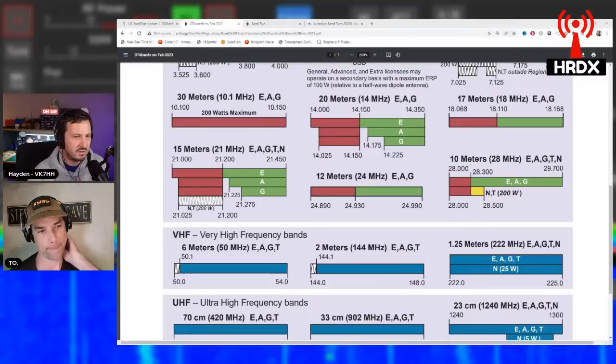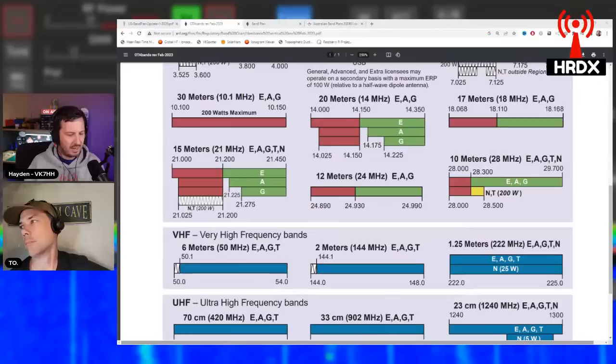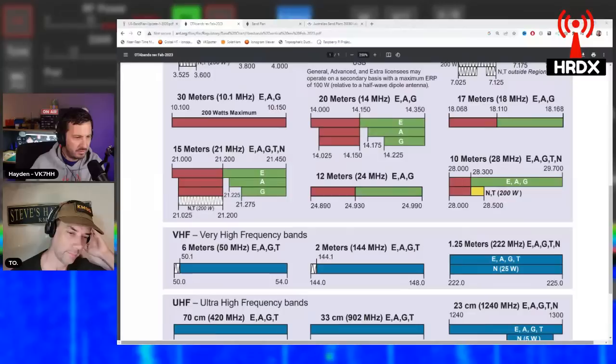And you're talking about another acronym, MUF and LUF. Oh, yeah. Maximum usable frequency and lowest usable frequency. You'll see those acronyms thrown around where you will have at any point during the day a lowest usable frequency that you can use and a maximum usable frequency. And that's basically what the F layer will propagate, right? Which is the highest layer in the atmosphere.